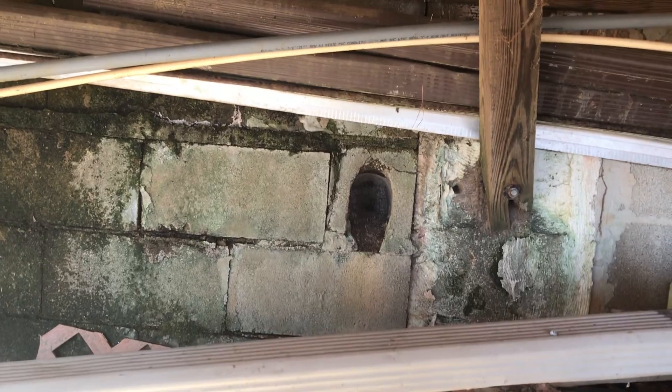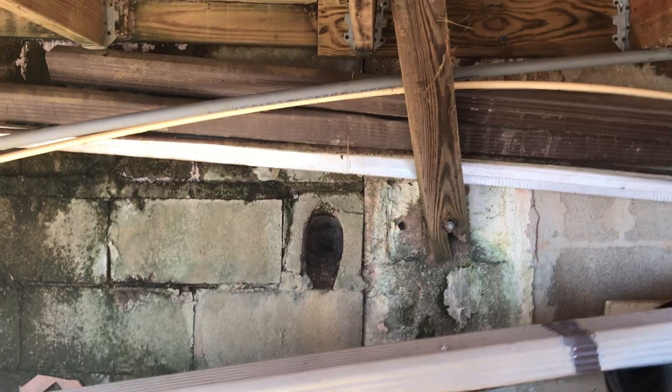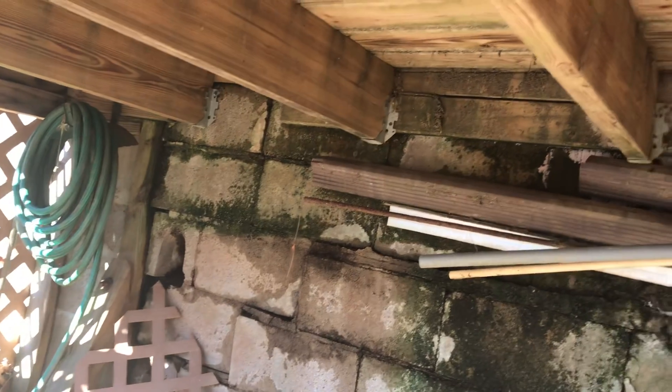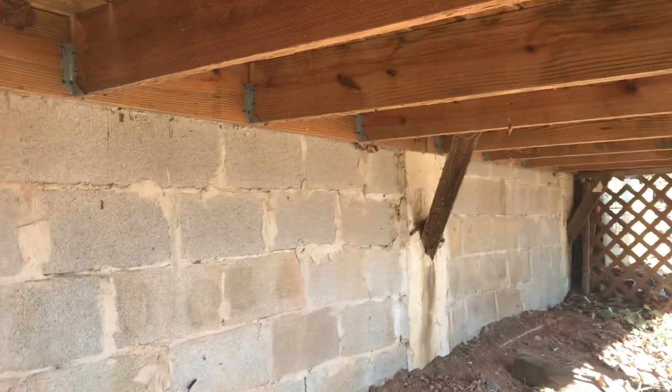Okay, they moved that — it's not even connected. That used to be in that hole I believe, and there probably was one there in that hole as well. There's been some work done here, which is good. See how those are connected to the cement with a lag bolt that goes all the way through and is tightened on the other side — but that one's crooked, not even connected. Those need to be addressed.